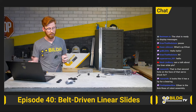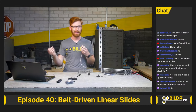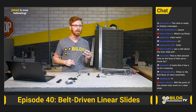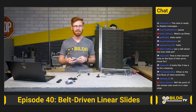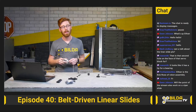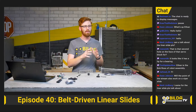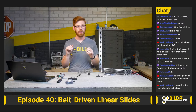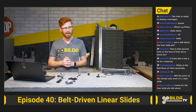Now let's look at what you really came here for. We're going to break down the individual parts we created to bring belt-driven linear slides from an idea to an achievable reality. Lots of teams have done belt-driven slides before — the first one I saw was at the 2018 championships, where Mecca Hamsters out of Minnesota had a really sweet assembly. I implemented it on a team I was mentoring, but I really wanted to make that process easy for teams. All these parts are designed for creating linear motion with small-scale belts.